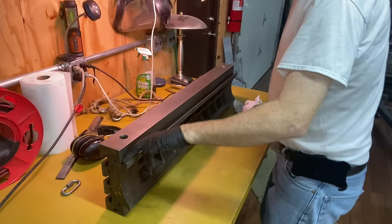Much, much later. As is tradition, I'm going to show some first chips. This is a little piece I made to fit into the table to take out one of those half moons, and it's protruding down below and interfering with the T-slot. Just looking at it — there's no way to measure — it looks like 50, 60 thousandths. So I'm going to try to just take the top off that, then take it off, put it in, and keep doing it until it's not interfering with the bottom of that piece interfering with the top of the T-slot.